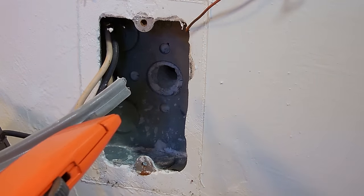If your electrical box has a space behind it, if you're working on a wood frame wall or a hollow core of a concrete block, you can take this ground wire, cut it shorter, place a little loop in it, then you can drill a hole in the back of the electrical box, slightly smaller than the threads of a self-tapping ground screw. You can then secure the wire to the back of the box.